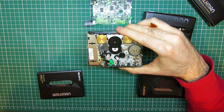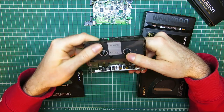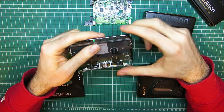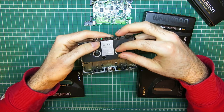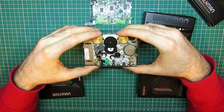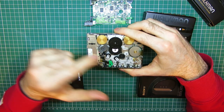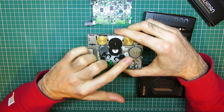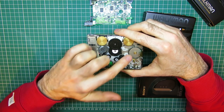That problem of cracked gears also applies to gears such as this one, which are on the back of the reels, the reel gears. If they crack, the reel is plastic, has a little plastic pin through that gear. If it comes loose, the reels just fall out, like that one did. There's a big element already of, yes, they eat themselves. Next problem, which this one had, these motors are renowned for corroding, failing, and this one, unfortunately, was completely unsalvageable.